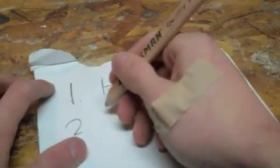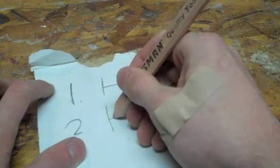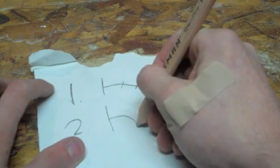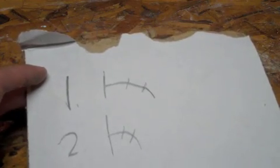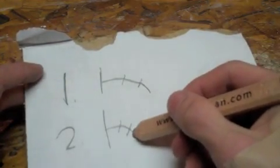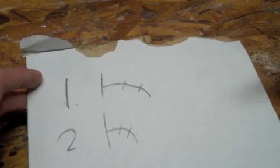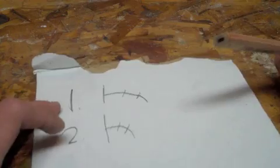The second one is when one half of the limb is curving, and then curving a lot, and then curving gently again. So right there, that's a bigger problem than a stiff spot. What you have to do there is you just have to take wood out from here and here. There's pretty much no other way you can do that except making the bow a lighter poundage, which is what I had to do on the last one because those are really annoying.